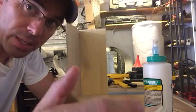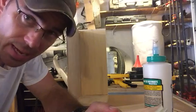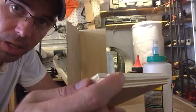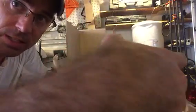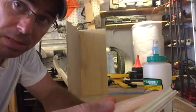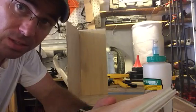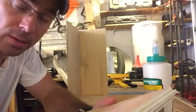Where you can use adhesives like this wood glue to the greatest success is if you make as much surface area bonded as possible. That means that you want the front of this tenon bonded, you want the sides of this tenon bonded, and you want the shoulders of the tenon bonded. If you do that, you've maximized the surface area in that joint to be bonded with glue. You will have both tensile and shear forces working to your advantage as you pull and operate the drawer.